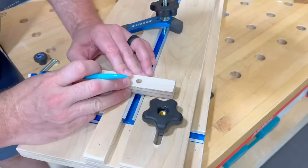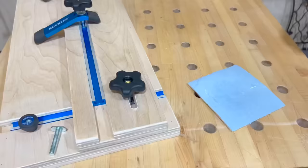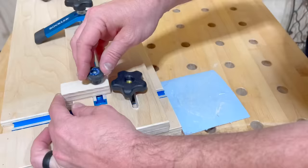The first change: this piece is just too bulky. I can't remove it without either taking the entire nut off or removing the star knob. So I'm going to make a few marks and trim it down at the table saw, sand it down, and now with this modification I can install it right through the T-track without having to take any knobs off whatsoever.